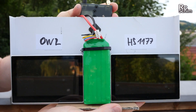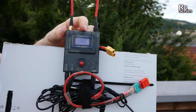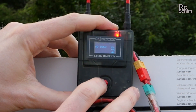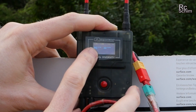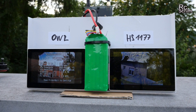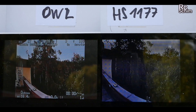On the receiving side I have two monitors from the Quantum V2 goggles, fed with a three-cell battery. On the back we have the Quantum Autoscan receiver with two independently working receivers, so I'm on channel 1 and channel 7 — far enough apart to see different images. There are some color and image distortions on the HS1177 because of the receiver not fitting very well to the transmitter, but in most cases the image is quite good.